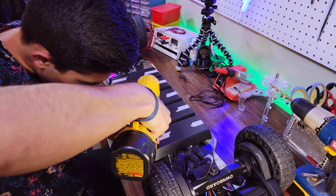And what I do is I stick a single nut onto the screw, and then I rotate it and put it all the way at the head, and you can just finger tighten it. And then the next step is taking a threaded insert, and you're going to put the slotted side towards the nut and just screw it all the way down.